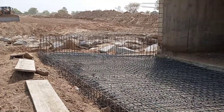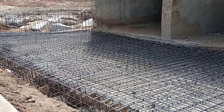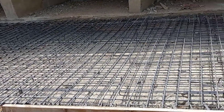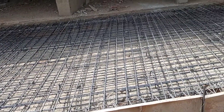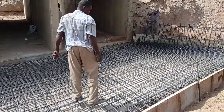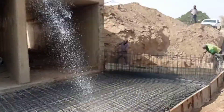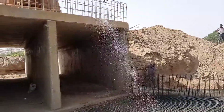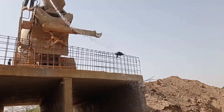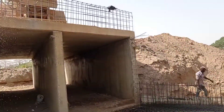The dimension of the beam is 0.25 by 0.35 meters — the depth is 0.35 and the width is 0.25. A concrete cover of 5 cm is provided, making it 30 by 40 cm. This is the inlet of the culvert. From center to center we have kept the spacing of 15 cm or 0.15 meters. Horse benches have also been placed in order to keep space between the top and bottom mat.